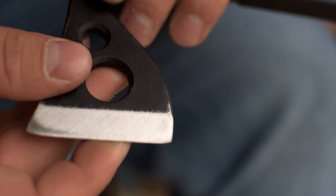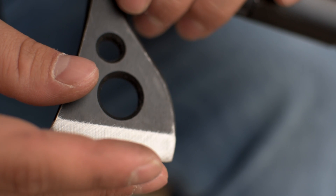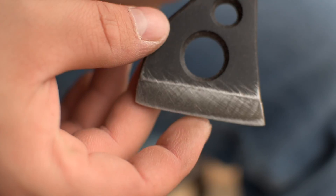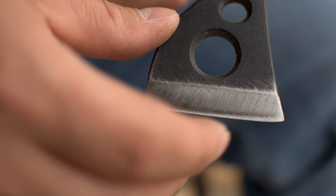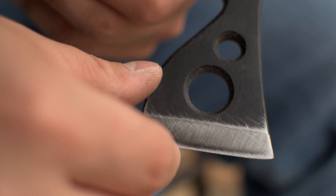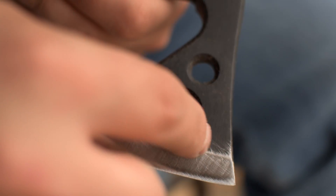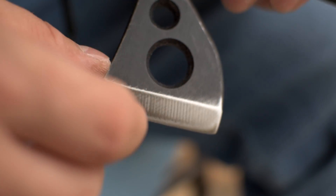I'm going to switch over now to some 100 grit paper and keep working this bit exactly the same. The edge there now is to an apex, but of course it's very coarse, so it's not really sharp at this point — it needs to be more refined. So, 100 grit paper, keep doing the exact same thing. So that's the 100 grit. You can see what the edge looks like. Some of those reverse strokes where I went a few strokes into the edge at the end remove any burr. We're getting a nice uniform pattern. You can see a couple light scratches up here on the black — that's just some paper dust or grit getting caught up, but once you get down to the finer grits, that won't matter. If it's a working tool, it especially won't matter.